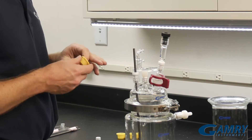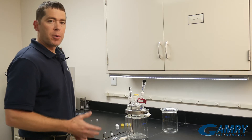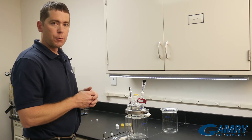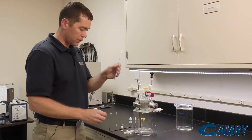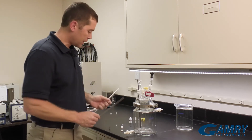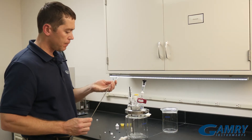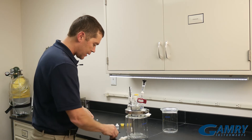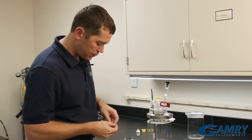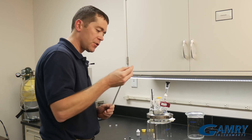Likewise, if you're not going to use one of the other 24/40 joints, you just take a simple cap and push it down. So the last part now is we're going to actually assemble our working electrode onto our working electrode holder. We have our regular metal sample, we have our glass rod, we have our threaded rod, and then we have some other small parts that I'll show you as we put it together. So we take our threaded rod, put it into our glass rod, and then we want to take our cone-shaped Teflon adapter, slide it over the threaded rod, and leave a little bit of the threads exposed so you can put your sample onto the end.